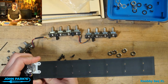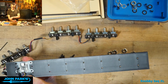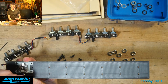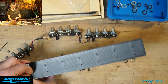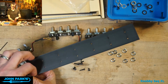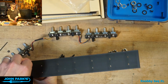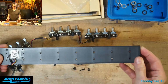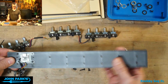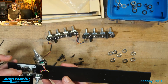All right, so there we go. That through there. You can, in fact, I think you can tell that I printed it diagonally because if you look at these fill lines on the first layer, those are usually diagonal at 45 degrees. So you can see I pretty much had a 45-degree angle on the part, and so it looks like it has vertical lines, which is kind of an interesting little hack for if you can't change that directionality, but you want sort of vertical lines. It's probably not as strong this way as diagonal, but there we have it. Okay, so now that's more what I wanted.